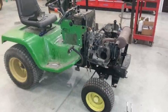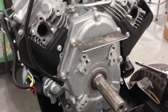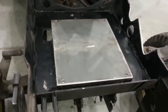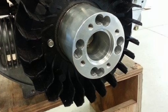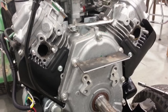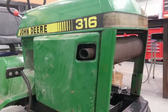This 316 was dropped off at my house by a family friend with a bad engine. My father-in-law worked at a local go-kart factory — they used Robin Subaru engines — and he had good connections to get me a good price on this 25 horsepower twin. To make it work in place of the original Onan, I had to raise it up about three-quarters of an inch with a special plate and put notches in the frame for the oil filter and oil cooler housing. It came with a flywheel adapter, but I had a retired machinist neighbor named Ed retool it to work with my stock driveshaft.